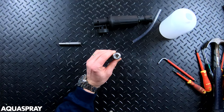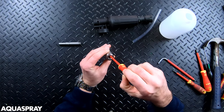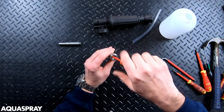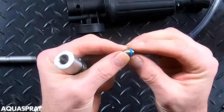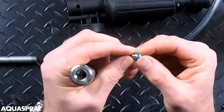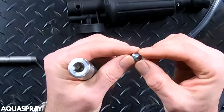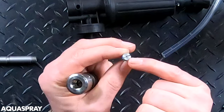There's a nozzle in there. With a little flat screwdriver, this should not be tight to get out. If it is really really tight it could be Loctited, which is wrong. It's got a tiny little nozzle and a little o-ring on there. Make sure that o-ring is okay and not too damaged. This one looks a little bit squashed but it should seal okay.